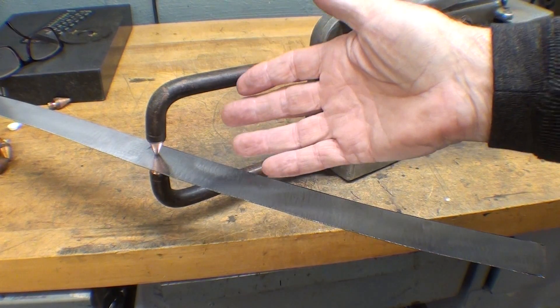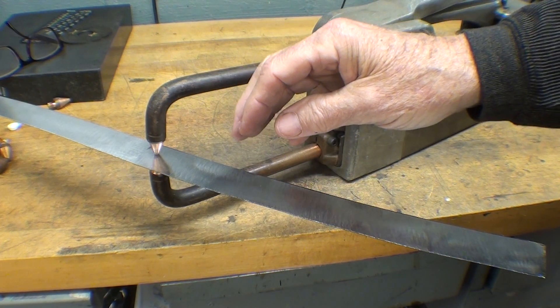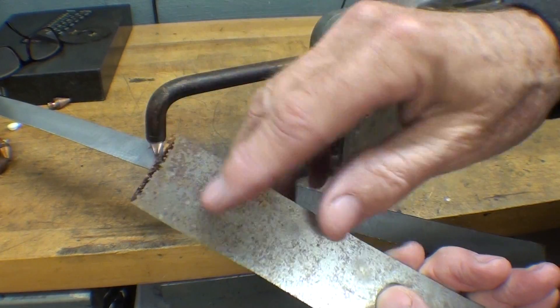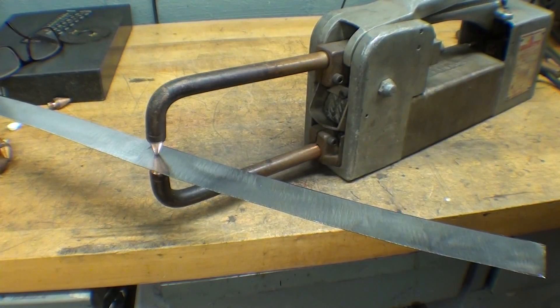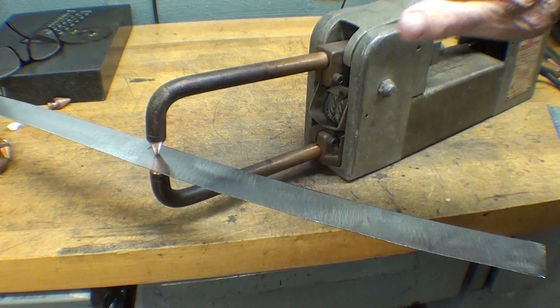You can spot weld almost any kind of stainless steel, but you must avoid galvanized metal, painted metal, or rusty metal. The samples I have had rust on them and paint on one side — you can still see the hammer tone paint; this was off of a filing cabinet. I have cleaned it with a grinder and again here I'm ready to weld.